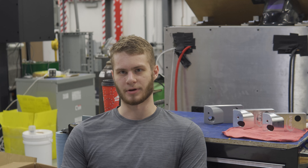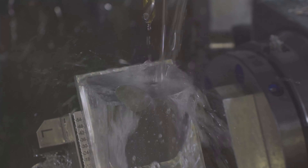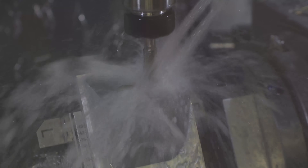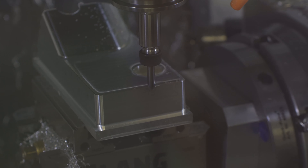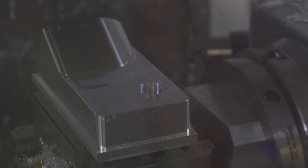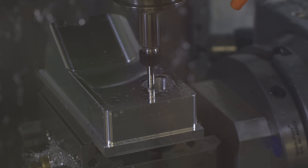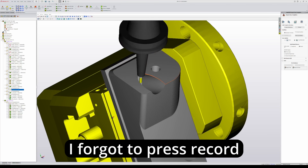The only drill we have for an M12 tap is a jobber-length drill, so I'm going to have to spot this before drilling so it doesn't walk on me. It's also just a standard cobalt drill, so I will be pecking when drilling. I'm also only starting the threads with rigid tapping and finishing them by hand. Most importantly, I'm going to add in some chamfers. Where I'm not able to chamfer with a chamfer mill, I'll 3D surface in the chamfer with a ball mill.